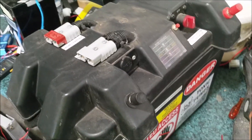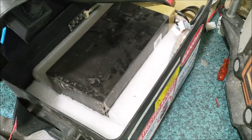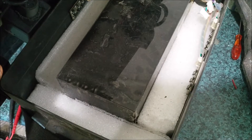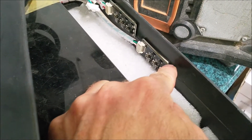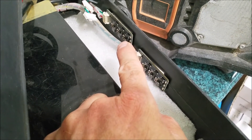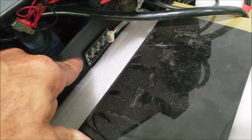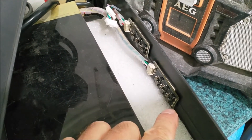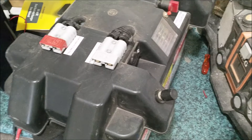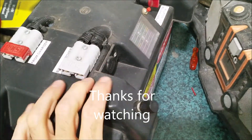Here's the finished product — a bit dusty, but anyway. Inside the lid you can see one of the packs, and I have the other two underneath with some foam so the packs aren't bouncing around. On the side you can see the resistive units that balance out the cells — one, two, three, one for each pack. As I mentioned, they're taking over the role of the BMS, determining the voltage of each cell relative to each other and balancing that voltage so they charge at the same rate. I've used it a few times and managed to run my camp fridge for three days without charging — it works pretty good, I'm happy with it.